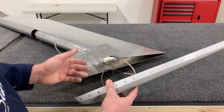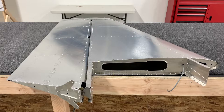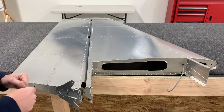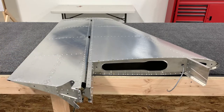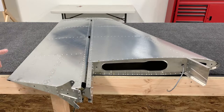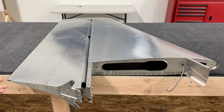The next step is to cleco and then rivet this assembly together and the rudder will be complete. Once the rudder is completely finished riveting, the last step is to check it for alignment on your vertical stabilizer. It's better to check alignment now rather than discovering a problem after paint or final assembly. One option is to leave the front overlapping skins unriveted until this step to make sure alignment is good and there's no twist, since the front overlapping skins are what really lock in the rudder's twist. Building on a flat surface, keeping the control bracket hanging off the table edge, and waiting until the end to install the counterweight should produce a perfectly straight rudder.